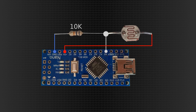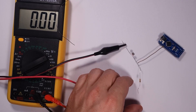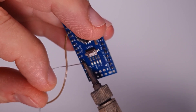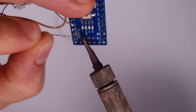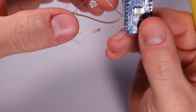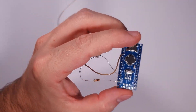So this is going to be the schematic I'm using for this project — pretty simple, you can pause it if you need to. I'm going to start the soldering process just very briefly. This is basically our voltage divider with the A0 pin connected in the middle. I'm connecting the end of the sensor to plus five volts here, and to ground I'm connecting the end with the resistor.